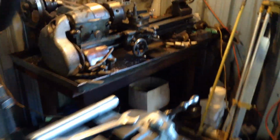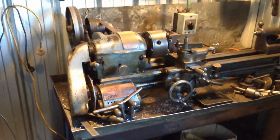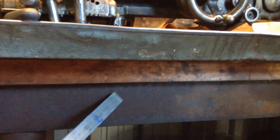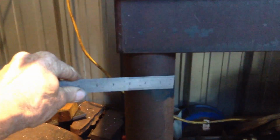And I'll tell you what, I get a few questions from people with lathes such as the Southbend, on what size materials they should build their stand from. Well, this one here, it's a steel frame sitting on a timber base, which is 1 3/4 or in our language 45mm timbers, on 100mm 4-inch angle iron frame, on 3-inch nominal bore pipe.